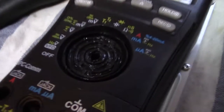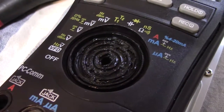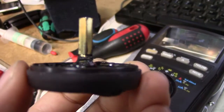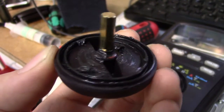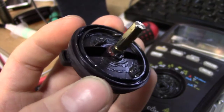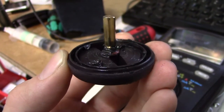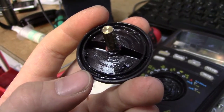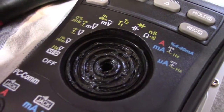There's quite a convoluted pattern in there which definitely benefits from it. The little axle was entirely ungreased, so that too was rubbing plastic to plastic. And then this little o-ring there to seal it in didn't do much good either. Also put some grease in this outer slit, because it goes over the big ridge on that side.